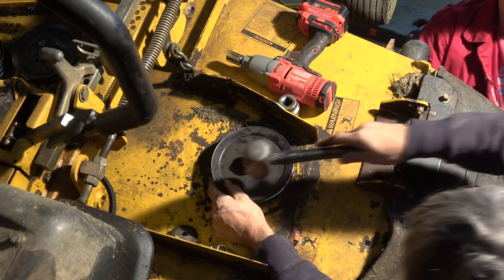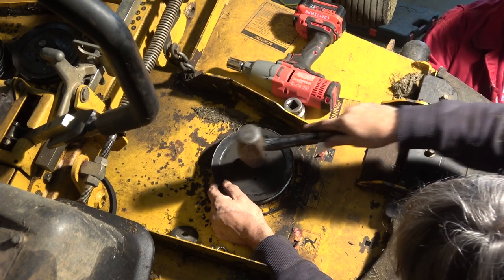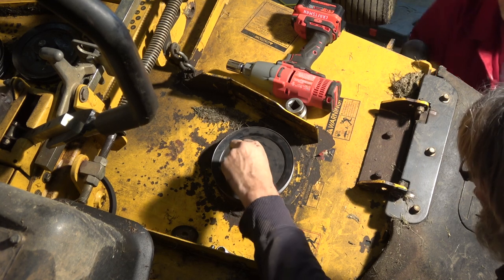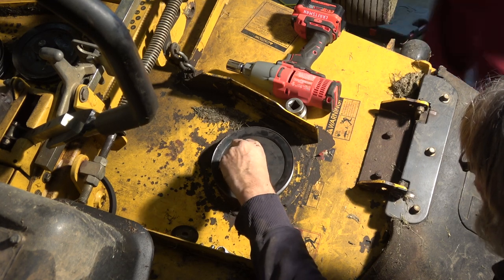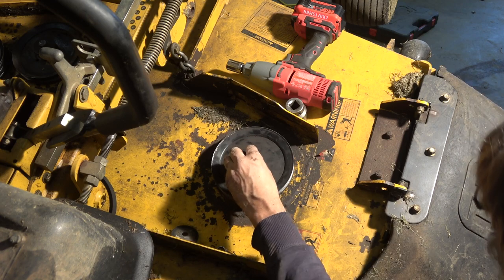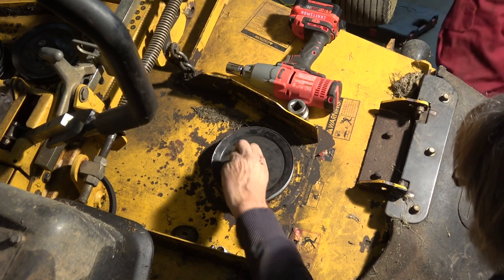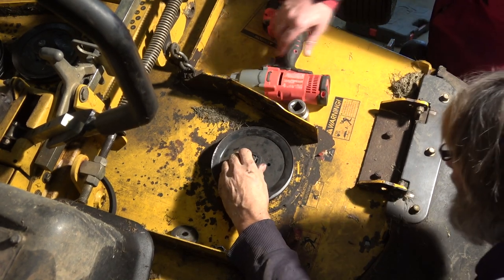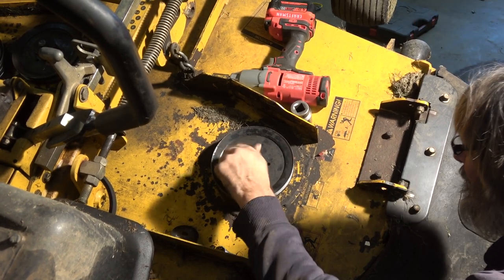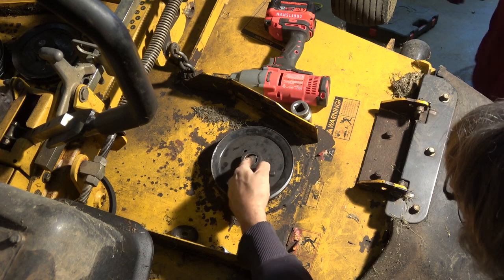If you do something like this and put bolts back in, you always want to tighten the bolt at the key first — at least that's what I always do. I'm going to drop them out that way — there's no ifs, ands, or buts. If you do have to, it's another spot to spray a little bit of penetrating oil. See, the problem with doing what we did — putting the bolt in there and driving it down — you got to watch to make sure it's moving and you're hoping the keyway stays with the pulley, not on the spindle shaft.